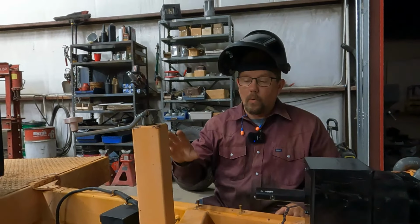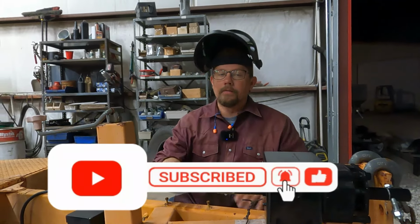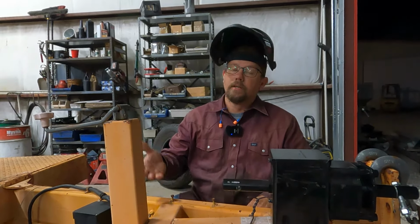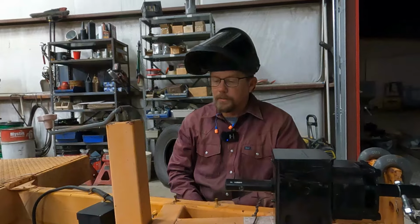Per our customer's request, we're just going to go to a larger jack. We're going to upgrade to a 12,000 pound static Bulldog with a 2-speed option, just to make it a little easier to dolly up and down. It will take you more cranks to get it up and down, but the resistance you're going to have to be messing with is going to be easier due to that 2-speed.